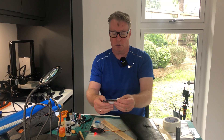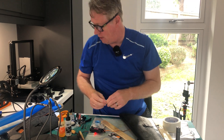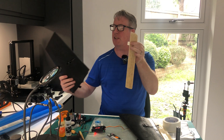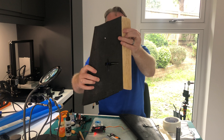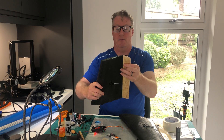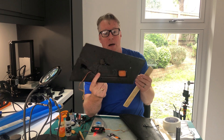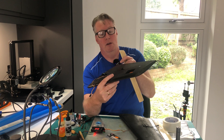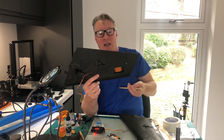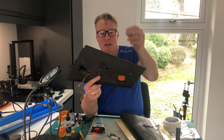I'm going to use what are called CA hinges — flexible plastic coated in a felt material. You cut a slit into your elevon, slide the CA hinge halfway in, cut a slit in your wing, and push the two together. Then you put a few drops of thin CA glue in there and it runs in, making the elevon solid to the wing. These CA hinges — a smaller version — actually come with the AR Pro kit, and on the underside of your AR Pro there are three markings for three locations to fix them. Sonic Model clearly had it in mind that people might want to replace the elevons.